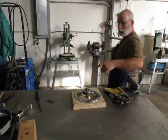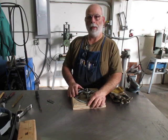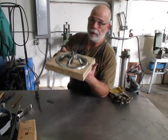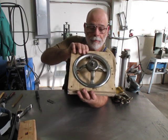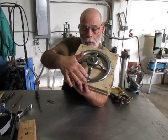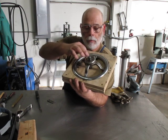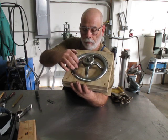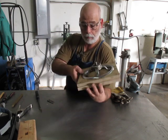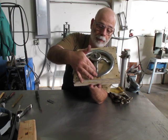I modified the fixture and went ahead and put the hand wheel into the fixture. You can kind of see here how it fits. These cast iron fractures are almost like gear teeth — they fit together incredibly well even though the thing was dropped on them. Some of these, like this one here, I can barely feel the fracture — that's how well it fits back together.